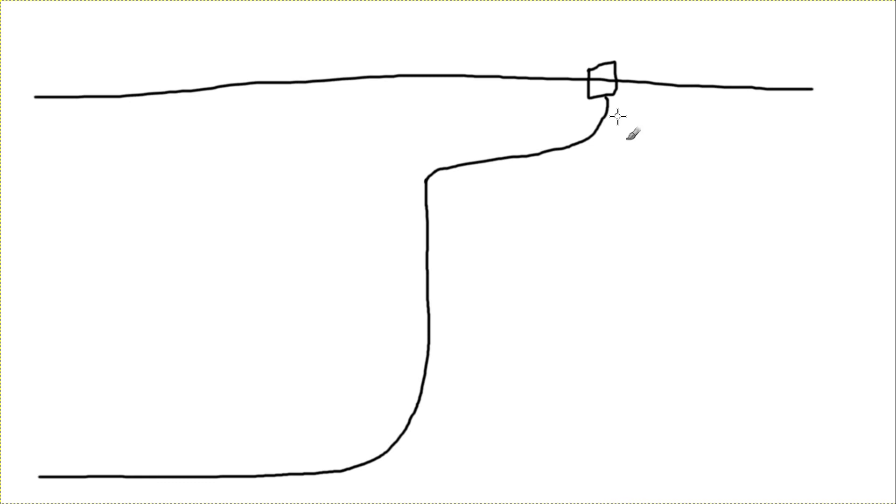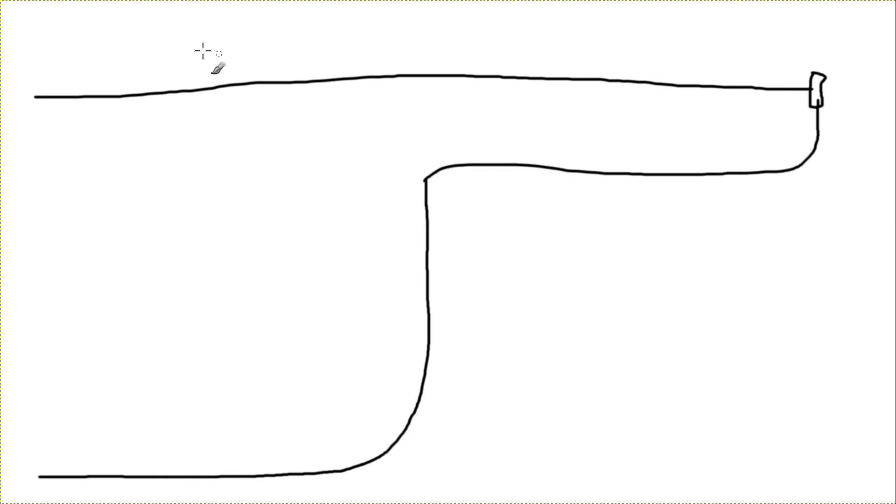The argument online on some of the confused sites is: well, we'll just feed it from the end. So it's an end-fed dipole — but it's not a dipole, because 'di' means two elements. And if you're feeding it against the shack electrical supply — an earth symbol — then you've basically got a long wire or a random wire, and you're feeding it against a counterpoise, or worse, your house mains wiring. This is not a dipole.